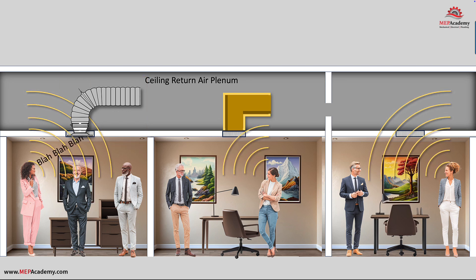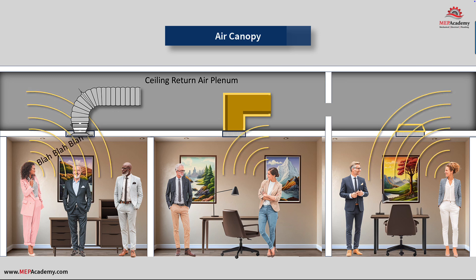The next method is to use a manufactured fiberglass or foam return air canopy, which is lightweight and sits on top of the return air grill without any additional support. The canopy also reduces visibility into the ceiling plenum. They come in standard sizes of two by two or two by one foot, and are usually less expensive than installing an acoustical elbow and install in less time.